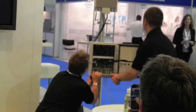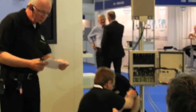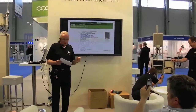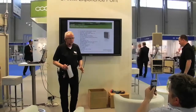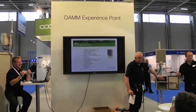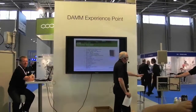Just connect the cables from the mast and apply 110 or 220 volts. Be aware that this control unit is what we call a TETRA Switching and Management Infrastructure — also called a TSMI. It has all TETRA features built in. DAM works with a distributed TSMI system, meaning — I will say it again — we have no central switch. That is very important. All information is saved and registered on every node everywhere. The control box has a battery inside and can handle 2 hours of operation without any external power. If you have a power failure, it can run at least 2 hours without external power.